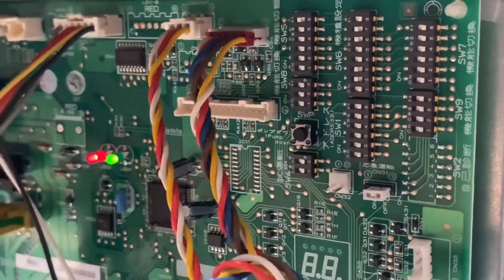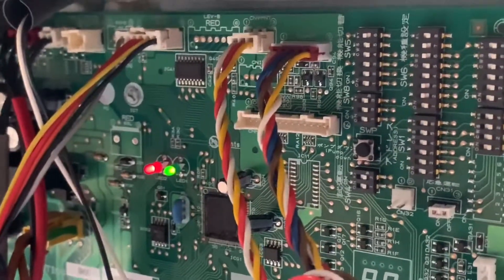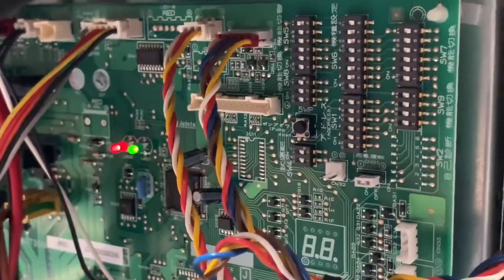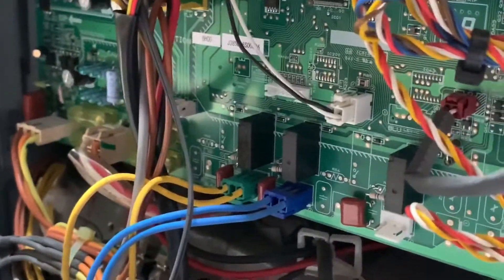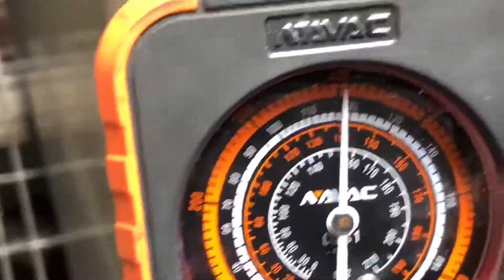The generic factory setup had all the switches in the off position, so the inverter didn't know how much to put out for the compressor — it didn't know what model it was. I think what was happening is it was cutting off on high amps. In the previous video we were running close to 12 amps, which is actually the full load amps. Look at our pressures right now — that's the high side.